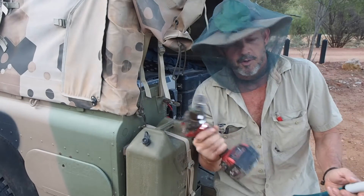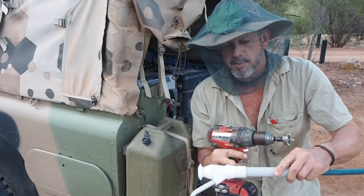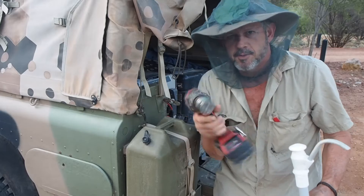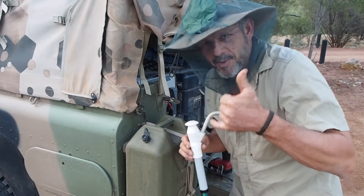Bit of a hole saw — this is a 32mm hole saw, that's a 30mm hole, but that's all I've got. So we just bound a bit of thread tape around there, cut a bit of garden hose off so the depth is right. You could get technical, get out the tape measure, but we're going to wing it.